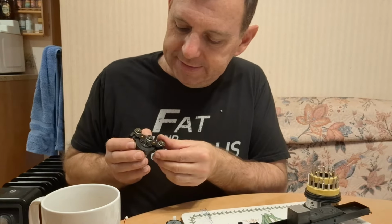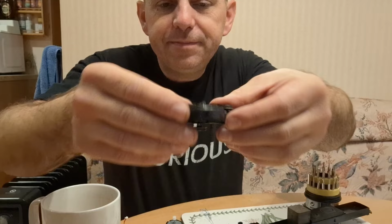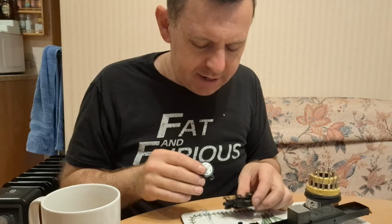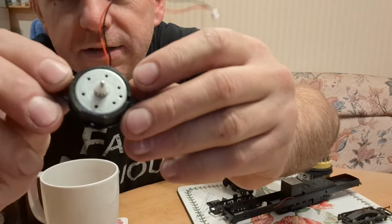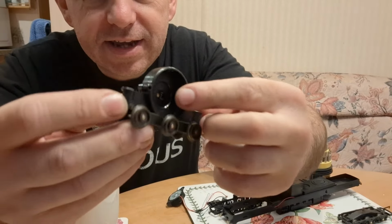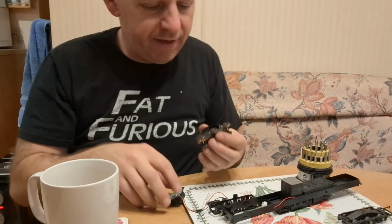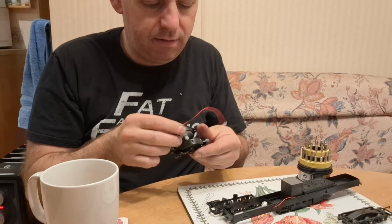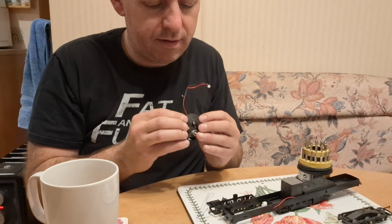So now the gearbox is all disconnoggerated. See that? So we need to insert a motor on this side. This one's slightly different because we have to push the gear on slightly further. This gear has been pushed further onto the motor. You see there? Because it needs to go inside this cavity with the gear and the bearing poking out the other side. You don't need that bearing. Will it clear? Yeah, easy. Should be able to slip it in there. Pop it through like that.